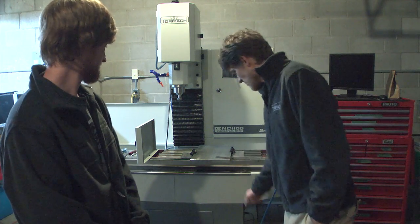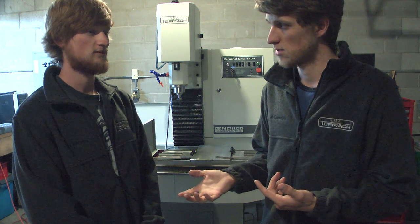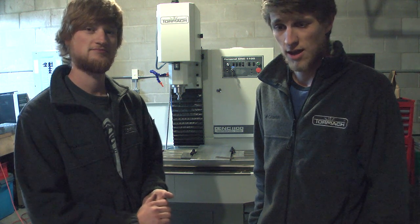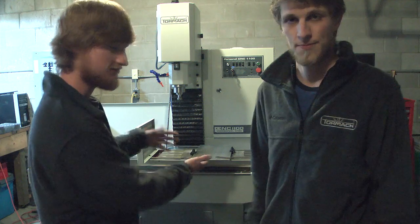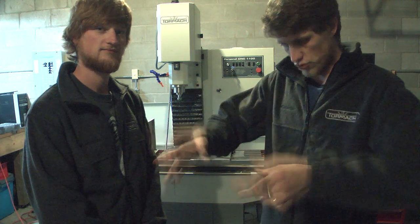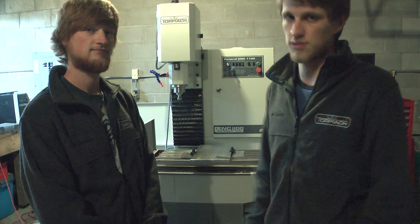Along with the cost of the machine, I've been spending a crazy amount of money on materials. Yesterday we went to Brian Tye's shop and got about $700 worth of RWL-34, which should do about 40 blades. Then we went to Intracut water jetting and dropped those off to get them water jet cut. Having the profiles water jet cut with pin holes lets us just drop them right on the fixture, bolt them down, and go — it saves a lot of time. We have four weeks until Blade Show.